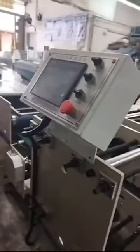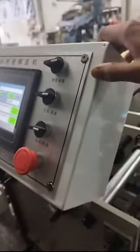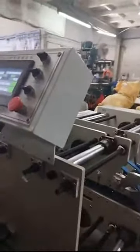This is also the touchscreen controller for this machine. In this touchscreen controller, you can set everything. You can also change the language to English or Chinese. You can open the main motor and turn on the rear — the rear refers to the conveyor belt here. You can also adjust the speed. The upper knob adjusts the speed of the paper feeding function, the middle one adjusts the speed of the main motor, and the lower one adjusts the speed of the rear. You can also adjust the pressure feeder speed — everything can be set by touchscreen.